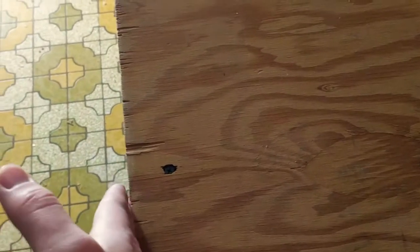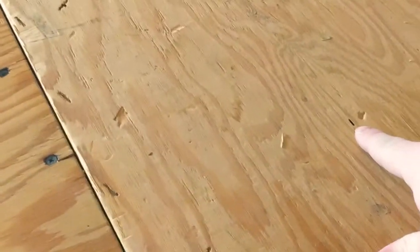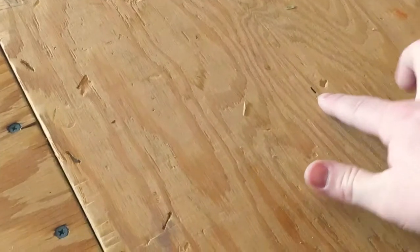The table itself is two feet wide, so when it's in place it'll sit right in line with this and come out right here because of the indent we put, so it sits up here. It's also an inch high, so we have to raise up this wood around it so it's even and the cushions all feel normal when you're laying on it as a bed. I need to cut this ten and three-eighths piece of one-inch wood — it's gonna sit all the way across here, and then I just have to fill in the little spot on both sides. Once I do that, when the table slides in it should all be flush and look good.